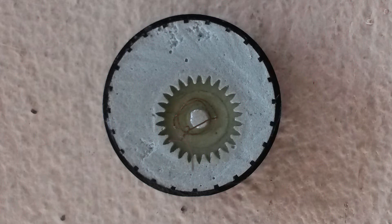That is supposed to be 2500 PSI epoxy theoretically by the manufacturer. The strength of this thing is going to be comparable at least to the gears it was replacing. This is not a large gear, not anything that requires significant strength. And again, as I said, if it does require significant strength, the glass reinforced plastic is probably the way to go.